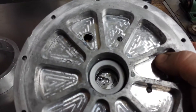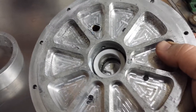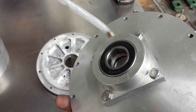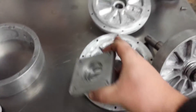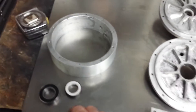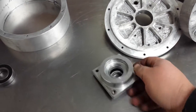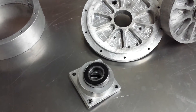The other half of the water pump seal is here. You can see it's a ceramic seal — you can get it on McMaster-Carr. There's a bearing on this side; this one's exactly the same. So this is the part that the seal actually goes into here, and the bearing goes on the other side.